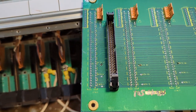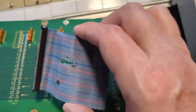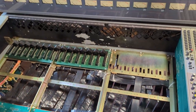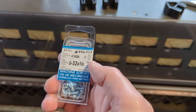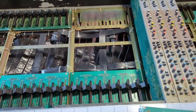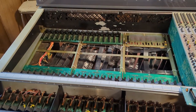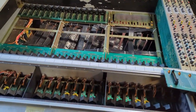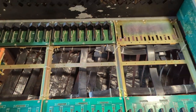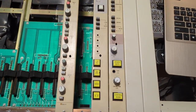One end has a male connector and the other is connected directly to the board. I've removed it, cut off the chewed-up cable, and I've got some replacement cable — I just need to put this on there and do that with all these motherboards. I've also picked up some longer screws that will fit in the motherboard, so I'm going to put the washers in to raise these up a little bit. My next step is removing the modules, getting under the board, and taking out every one of those ribbon cable connections and the upper motherboards. The lower motherboards just get washers underneath — thankfully they aren't ribbon-cable connected. They all ribbon-cable connect over to the master module, the console module, and the speaker module.